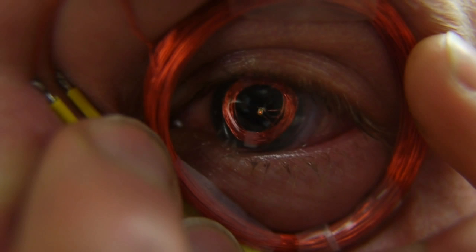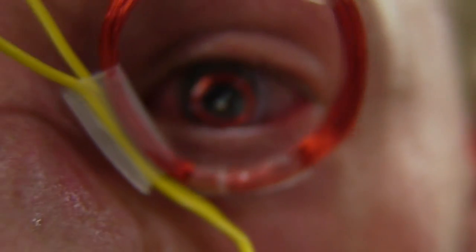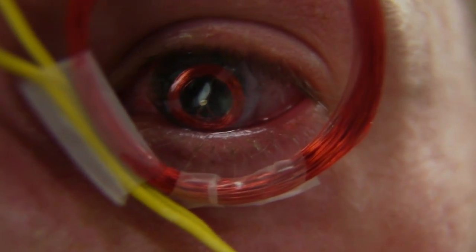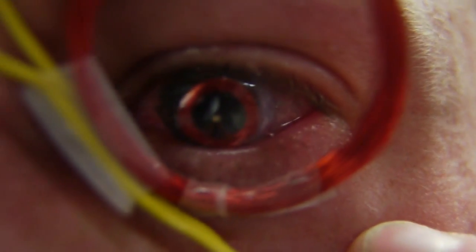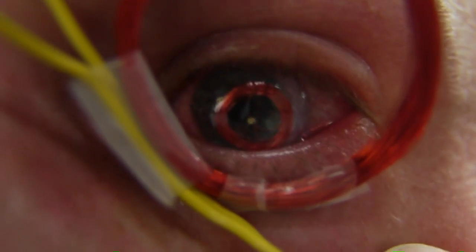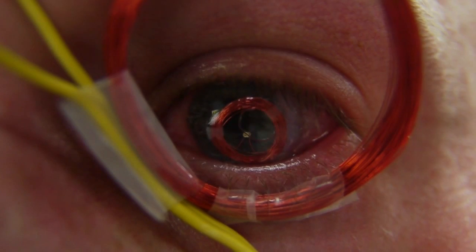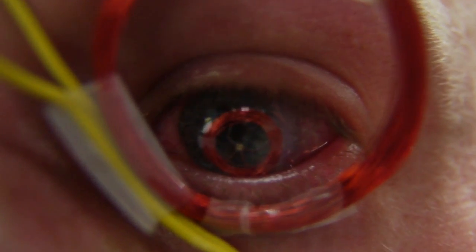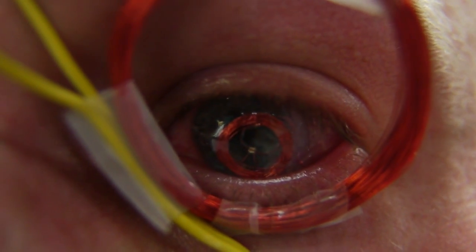So take a look — here's some more footage of the LED flashing in my eye. I did this for your benefit, so the LED is facing outward. If I were going to make a real VR display with this thing, obviously the LED would have to face inward, which I also tried off camera. The light is unfocused. One of the problems with building a display in a contact lens is that there needs to be a lenslet or a small lens between the light source and the edge of the contact, otherwise the light just sprays out into your eye and covers the entire retina.